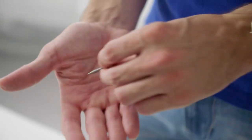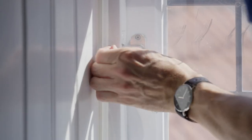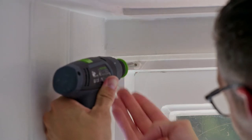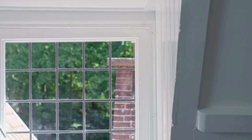Now take the screws and apply the washers. When you have the screws ready, remove the protective film at the positions where the secondary glazing is fixed with screws. Now you can start fixing the secondary glazing with screws. You do this with a cordless drill set to low speed — you will need a torx bit for screwing. Screw in the screws gently to avoid tension on the window. Now you can remove the protective film from the other side of the sheet and clean the secondary glazing well with an anti-static cloth and anti-static cleaner. Now you can enjoy the stunning end result.